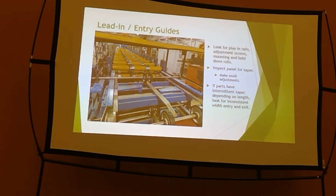I don't mean, if you're running it too tight and you're rolling an edge, that's trouble, but a lot of times I see on a short coupled roll former from a shear, they will basically use the shear's lead-in guides to align their roll former and leave it open. And if you get away with it, that's great. If your conveyor between your shear and your roll former has that torn up nasty edge where that little piece flops around and it runs around a million times, it's taking the leading edge of that panel and it's moving it all over the place.